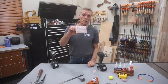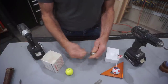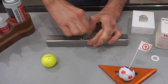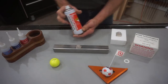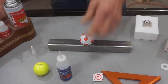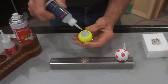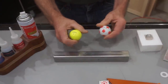These one inch diameter by an eighth inch thick neodymium magnets are kind of a specialty item, so I've included a link in the video description if you need to get some and can't find them locally. I use CA glue to stick these on, but first I stick a magnet to a piece of solid steel and then rough up one face with 36 grit sandpaper for better CA glue bonding to the slick metal coating on the magnet. Make sure you heed the warning on the box — these magnets are not a toy and a moment's inattention will earn you a blood blister on your finger, guaranteed. Next, spritz the roughened face of the magnet with accelerator, dab a good dose of medium viscosity CA glue into the hole in the back of the ball, then press the ball onto the magnet, hold it in place for 10 seconds, and you're done. Two golf ball magnets, good to go.